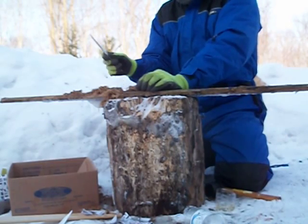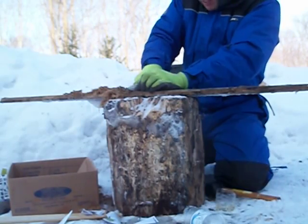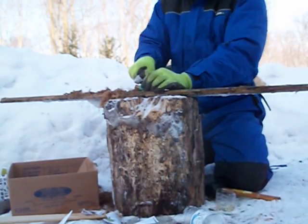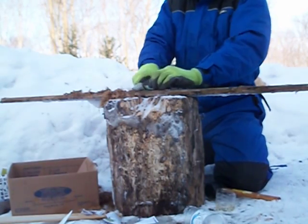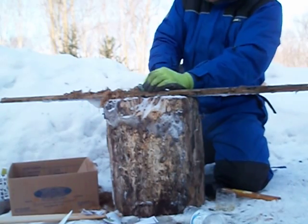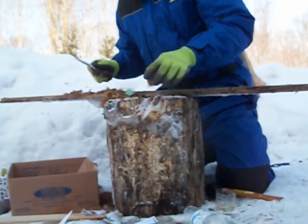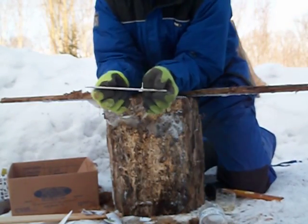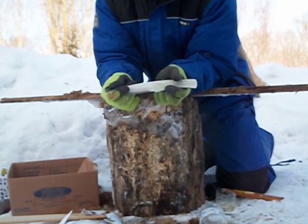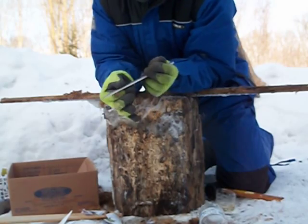The thing about epoxy is it usually is not your best choice for cold temperatures. I deliberately chose this bonding method, which is not epoxy, for cold temperatures. According to the spec charts of the manufacturer, it actually gets stronger as it gets colder, but it loses some shock resistance. But in all cases, its impact toughness is better than epoxy. Because sooner or later, if you just take a sheet of steel or titanium and epoxy it to a plate of carbon fiber or G10, it's going to fail at that glue joint.